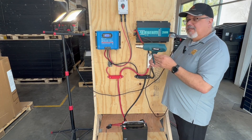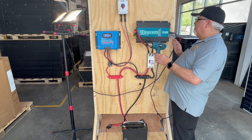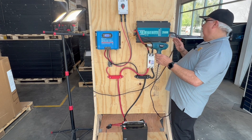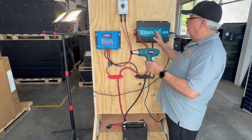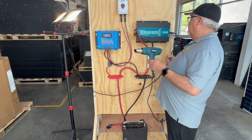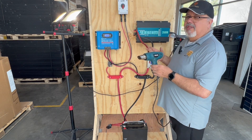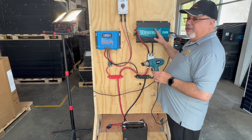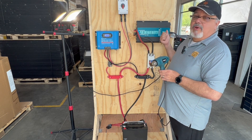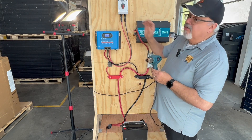At this point the heat gun is running at full capacity at 1,200 watts, and according to our inverter display, we have 11 volts DC going to it — drawing that much from the battery. It's at 111 volts AC currently being output from the inverter, which means it's consuming quite a bit of amperage. As it settles down, we're floating between 10.8 and 11 volts DC from battery into the inverter, putting out about 110 to 111 volts AC — more than enough to run the heat gun at full capacity and our LED lights.